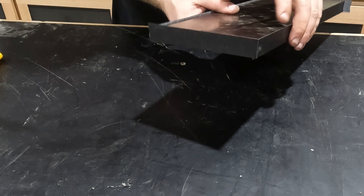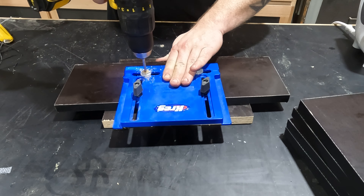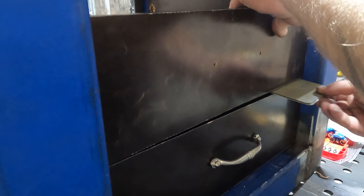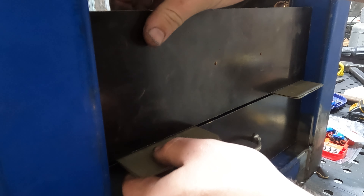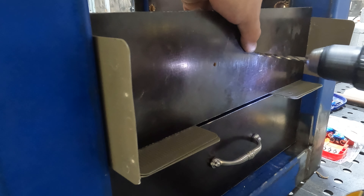Using a drill guide to drill these holes is a no-brainer for me — if you do any of these projects with any kind of regularity, they are such a time saver. Now that we have the faces drilled for the handles, I'll pop in some shims to set the spacing and drill through the front of the drawers to attach the handles, then come back and sink a few screws in from the backside to hold everything in place.